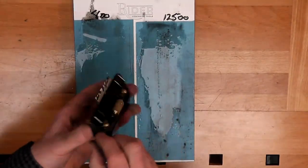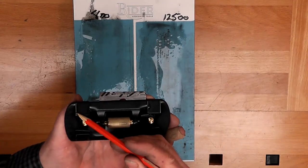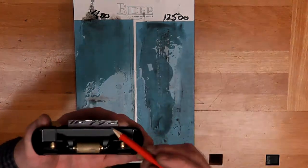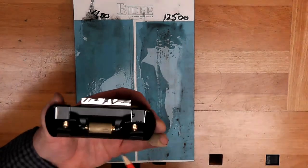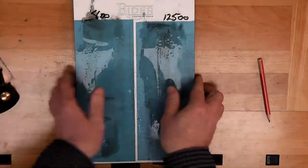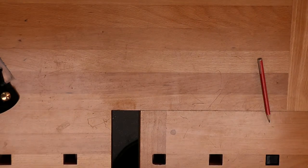Because, and this isn't in the manual, this has these little triangular blocks. There's one there, one here. They have little support barriers that make contact with my blue paper before the blade does. All right, so, or exactly the same point probably. So if I use it on a scary sharpening board, yes, I'm going to wear a bit of material away here. So in reality, I need something narrower to sharpen on.